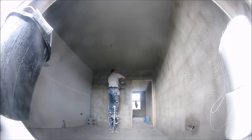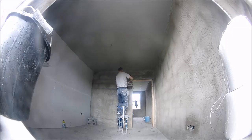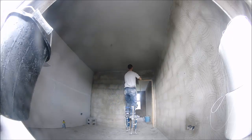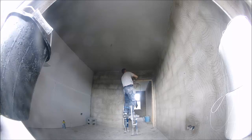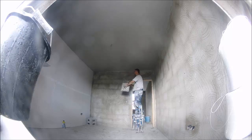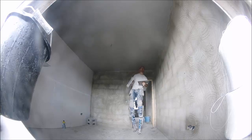The ceiling tightens from one end to the other, so when you're troweling you're following the same pattern as you laid it on. There's no point coming to the far end where it tightened a lot quicker — keep going over it the same way you started and get into a bit of a routine, a pattern. Repetition is a big thing in plastering — keep repeating what works for you. Sometimes you might not think it's working but you may just need a bit more time and you'll pick it up.